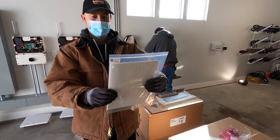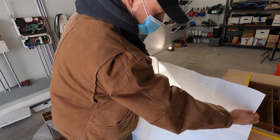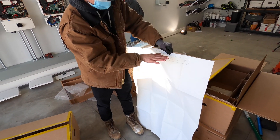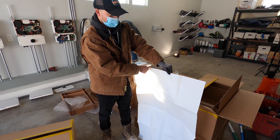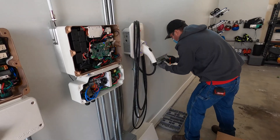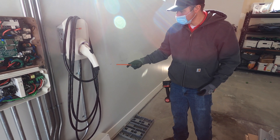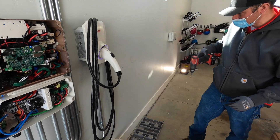There's a separate plastic bag with this thick white paper. So if you tape this up against the wall and have it rest on the floor, you know exactly how high your bracket needs to be off the floor. You're going to adjust this to make sure that you're hitting the studs and getting your bolts. We just marked for studs — the one right there in the center we're going to try to hit, and then we'll put just a toggle bolt on the other side.